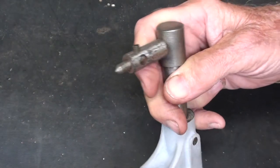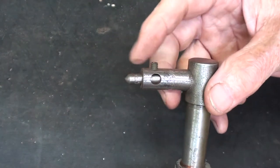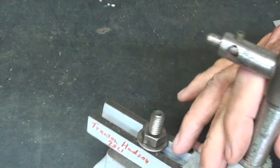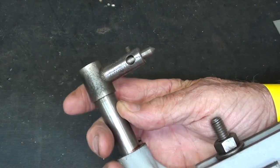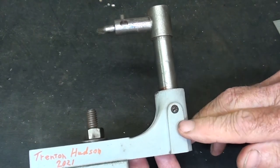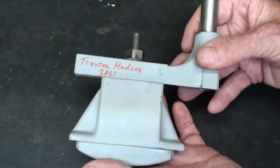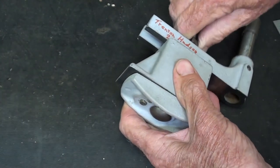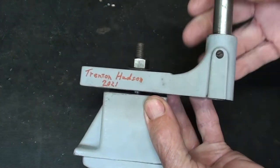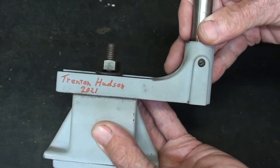There was no diamond nib in here when I got this from Trenton, but fortunately I had one in stock. Notice that it can be mounted straight like that, or crossways, depending on your setup in the machine. This post can be raised and lowered, and I already have it set on a little red line so that it will be on center. And this is what clamps it to the bed. Almost looks like a little shaper, doesn't it?